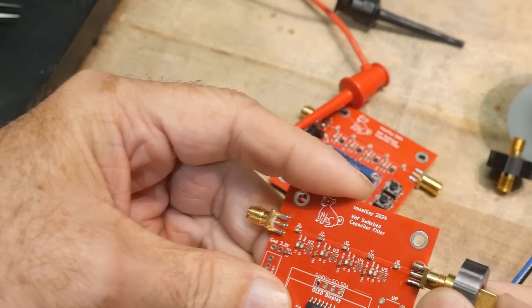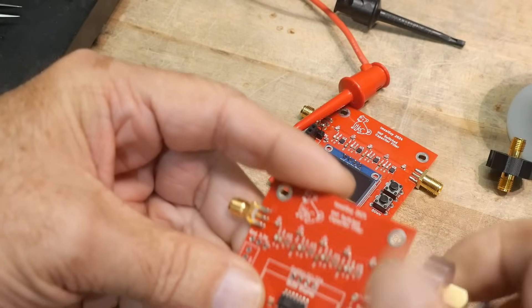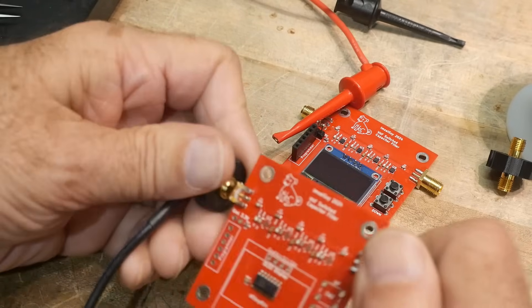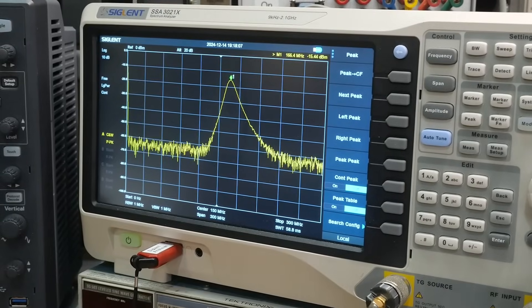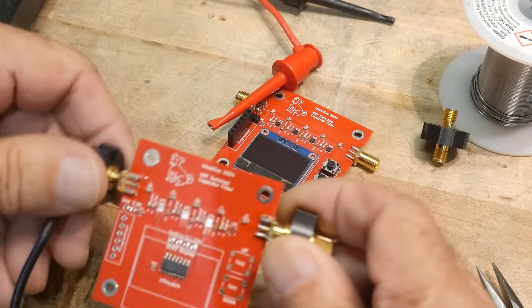With none of the little tuning capacitors, it should still act like a filter — just maybe not at the right frequency. This removes any obstacles the digital capacitors might introduce, giving us a dumb filter. Looking at that one, it's bigger — we've got about a 15 dB loss. I need to re-read the paper on anticipated loss. I would have liked to see no more than 5 dB on a passive filter, but maybe 10 dB is reasonable. This one is peaking right at the same point, 166 MHz.